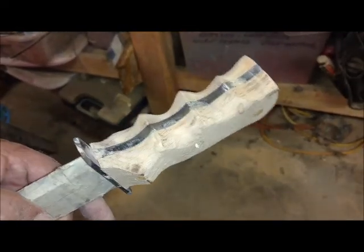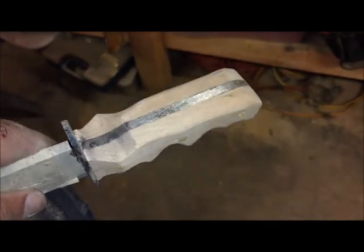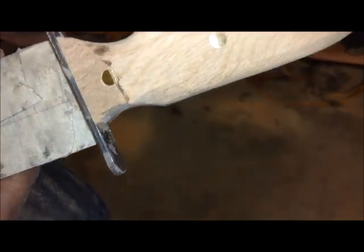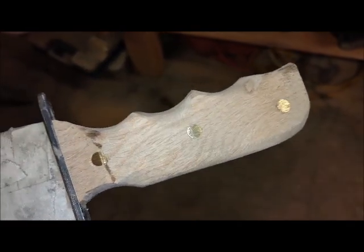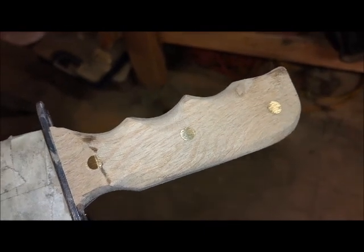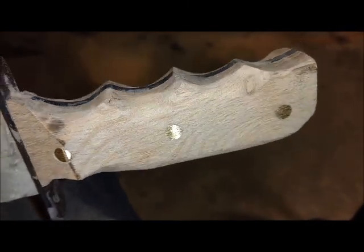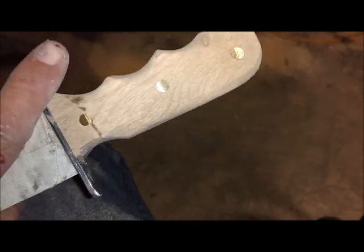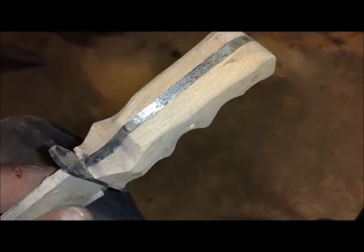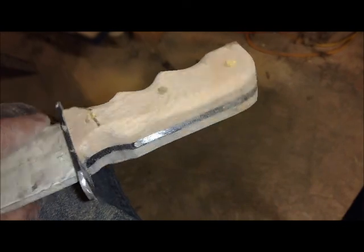There it is with the handle roughed in and shaped. Now it needs a ton of finer sandpaper. Mostly I did that with a rasp and a dowel rod with about 60 grit sandpaper — pretty coarse. That's what I used to do the finger loops and round them off a little bit. You can see a lot of scratches, and I hit it on the belt sander a little bit which is where it burnt a bit. Shaped it with the belt sander, a rasp, a dowel rod, and sandpaper.